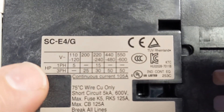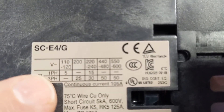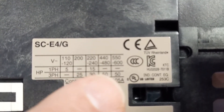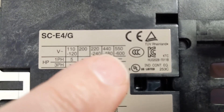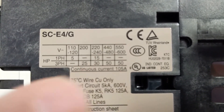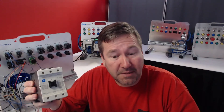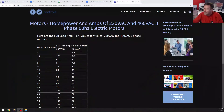On the side of relays and contactors you're going to see a chart like this and it's going to tell you what horsepower at either single or three phase that you can run and at what voltage. So at 220 this is good for 30 horsepower and at 480 this is good for 50 horsepower. That 50 horsepower does not correlate to the amps of this contactor — this is an 80 amp contactor.